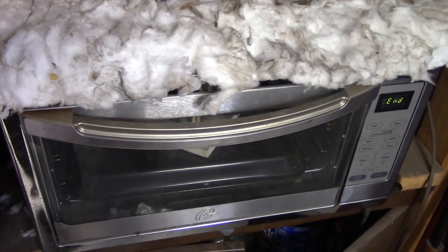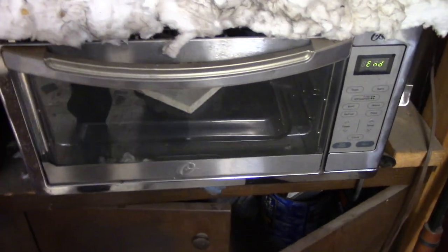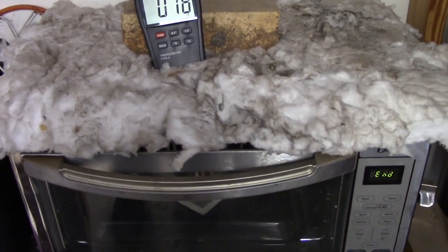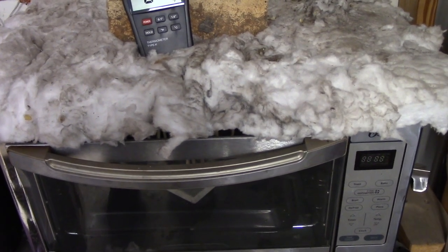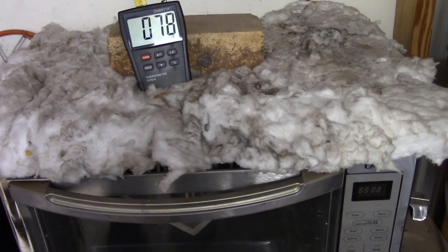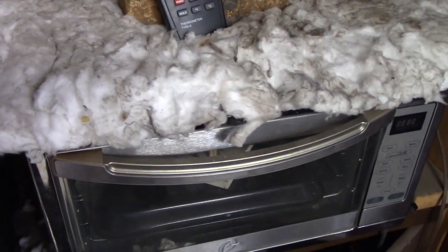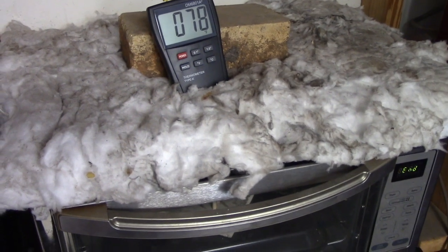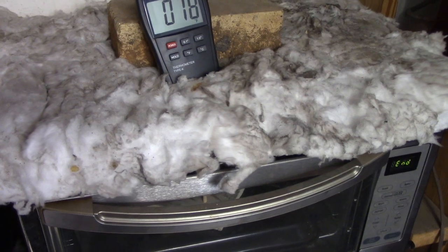The reason being is because the particular kiln that I have is not very accurate at lower temperatures like it is at higher temperatures, and it's very difficult to control the temperature inside there. It's very easy for that thing to ramp up 20 or 30 degrees or sometimes 50 degrees when those elements fire up, and I was overcooking and over tempering my blades when I started tempering with it. Talked to a buddy of mine that has one. He said, oh yeah, I don't use that for tempering either. I just use a toaster oven mainly because it's more controllable.